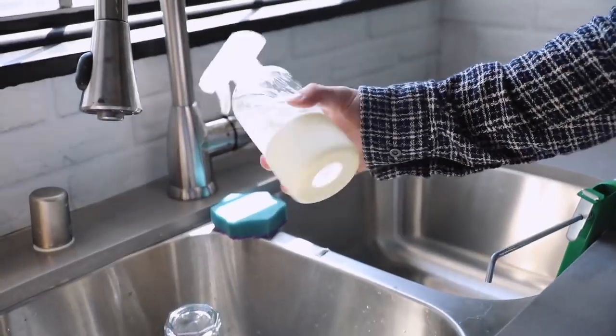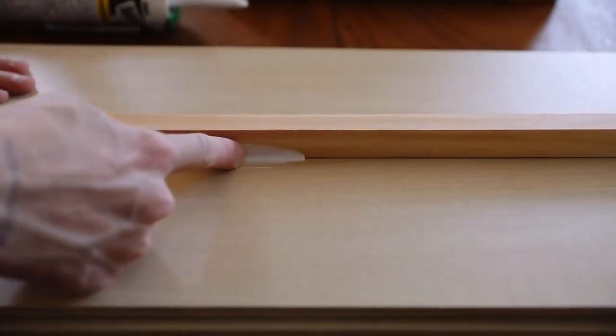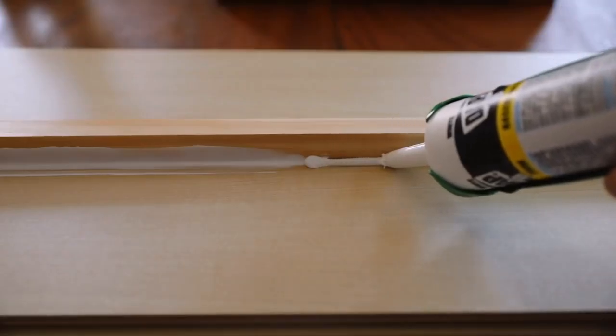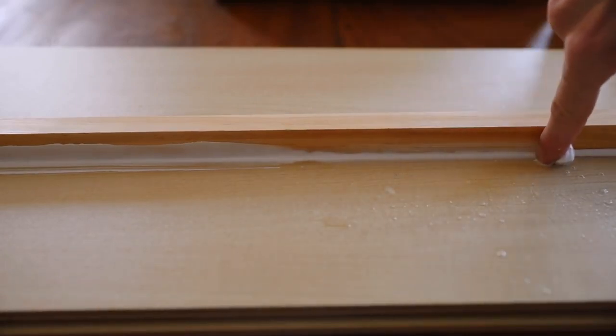Just two more for you. This is a great tip if you're doing a lot of caulking — for a board and batten wall, beadboard, baseboards, whatever it might be — basically to eliminate how messy caulking can be. Fill up a spray bottle with some water and a couple pumps of hand soap, mix it up, then pipe your bead of caulking across whatever you're working on. If you do it with just your finger, it gets really messy and goes everywhere. But if you spray a little bit of the soapy water over the top of your caulking, it keeps it consolidated in a clump — so much easier to work with. It just glides across the baseboard or molding, easier cleanup, not dripping or falling. It kind of stays together, which is strange but it works so well.